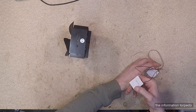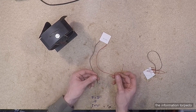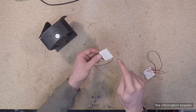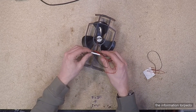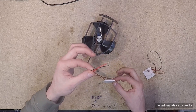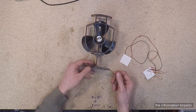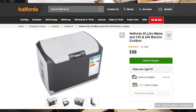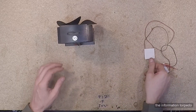These peltiers are quite clever bits of kit. If you apply a voltage to it, one side gets hot and one side gets cold. The other thing you can do — as used in this application — is sandwich it between two metals and apply heat to one side; if it's hotter on one side and cooler on the other, it will produce electricity. Cool boxes use these too: they put voltage in and use the cold side to cool the box, blowing the hot side away.